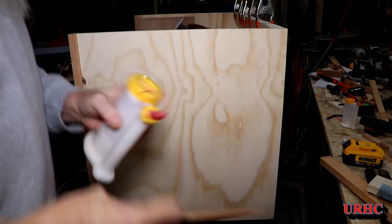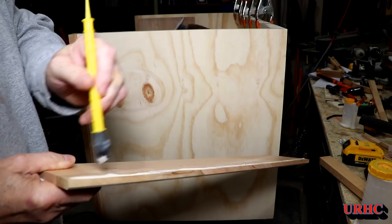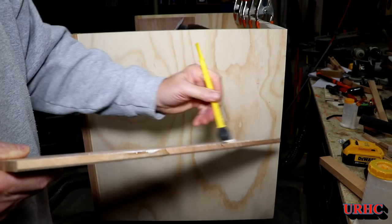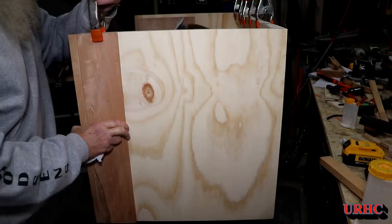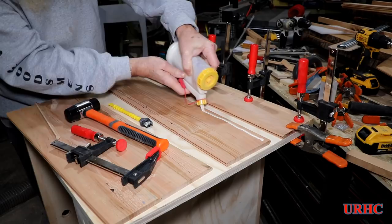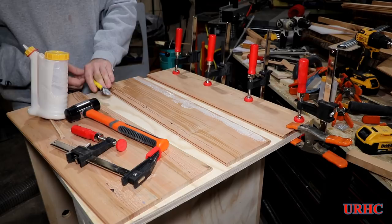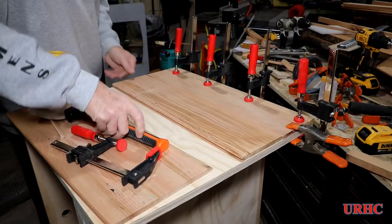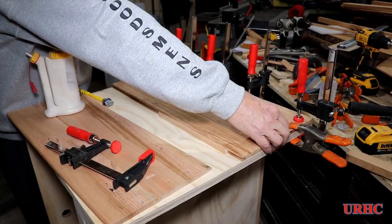Once the glue is set, it's time to put some tongue-and-groove on the outside. The first piece I actually cut the tongue off — I wanted that side to face the front. I'm running a strip of glue on just one side, because natural wood always expands and contracts while the plywood won't. So I'm gluing just one edge of these to the cabinet and letting the other edge basically float so it can expand and contract. Over a three or four inch area like this, the movement won't be very visible. I was going to use some pin nails but didn't want anything showing, so I decided to just glue one side like this.